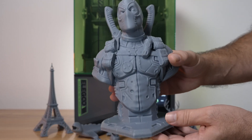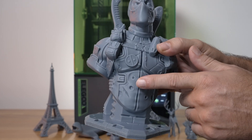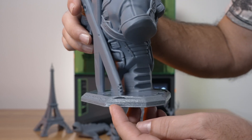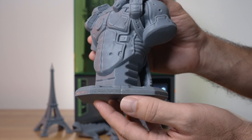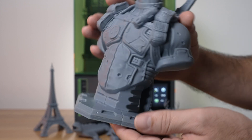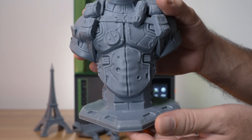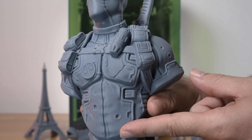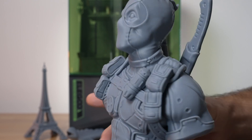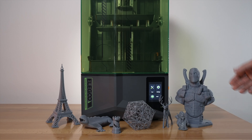The last print is quite large — a model of Deadpool. For the most part it turned out great, except for the bottom part. This is hollowed out and drained from the top — I have a plug in there and also made a hole in the back so I could wash it. We had some delamination on the bottom, likely from not enough layer exposure for larger pieces. There's also a little cracking on the bottom from resin inside trying to cure that wasn't cleaned out well. But if we ignore that and look higher up, the detail is incredible and this thing turned out very, very nice.